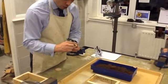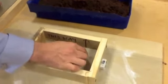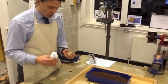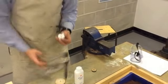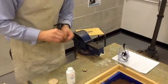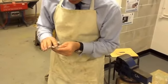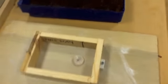We brought up the disc earlier and now it becomes important — we're going to place it into the box so that it faces upwards. We want to be able to eventually take this pattern out of the sand mould, so to help with that we're going to apply some talcum powder onto the MDF disc. Using a brush, brush it all around the MDF, particularly concentrating on the edges, because that's where the sand tends to stick.